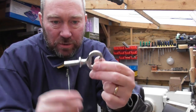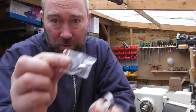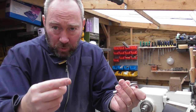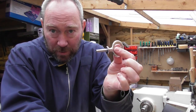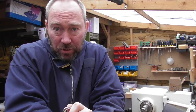Now if I had any sense at all I would show you the easy way of doing it and use one of our chrome end caps. This doesn't come with this as standard but we do sell these separately. It's a little chrome end cap — it means you can put a 6mm hole in one end and an 8mm hole in the other end, and you can then turn between centers, which makes it really easy. But as that is extra, I'm going to show you how to make a handle for this part only with an 8mm drill.